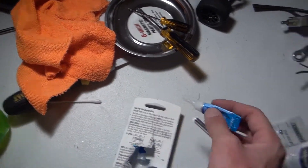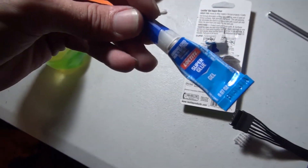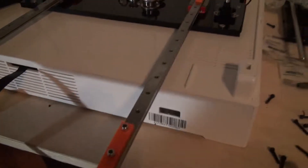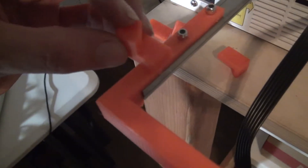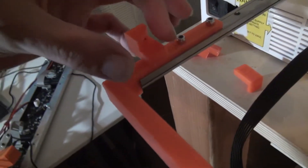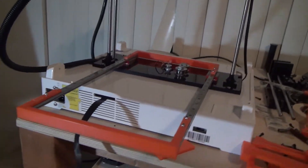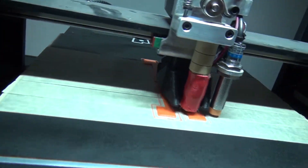This is probably the end of tonight — end of Sunday. I tried to put some CA glue on the little pieces and glue them down, but when I started pulling the bed stuff off, the old build tag popped off and it got me thinking this probably isn't the best approach. So I'm going to redesign it to be more like this piece — something that slips in here. Instead of little tabs that hang off like winglets, maybe we drop down a little bit or use a captive nut that goes on here too, just to make it a bit easier. We're 3D printing some new pieces now — hopefully these will hold the bed a little bit better.